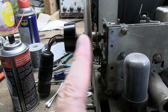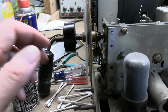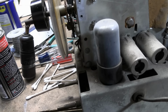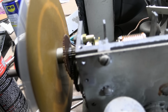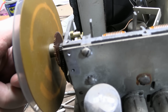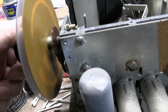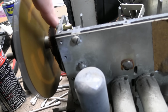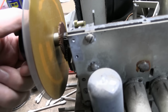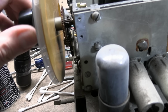One, see how the gear is kind of bent this way. I'm not sure if that's right or not, or if the shaft got bent. But a much bigger problem is this outer gear, this guy here. It's phenolic, and I'm guessing somebody tried to turn this knob while the shaft was all gummed up, and they really chewed the heck out of about a fifth of the gears on here. And when that section gets down in there, it starts slipping